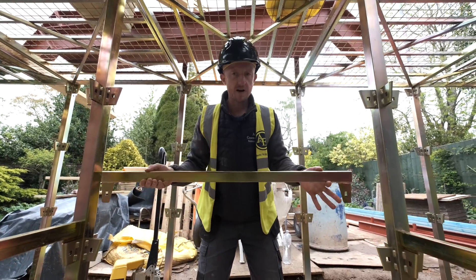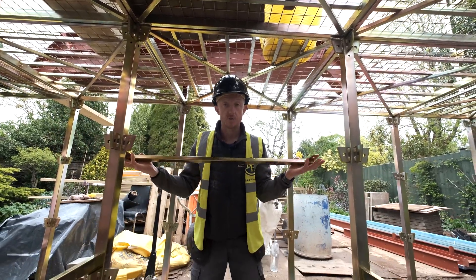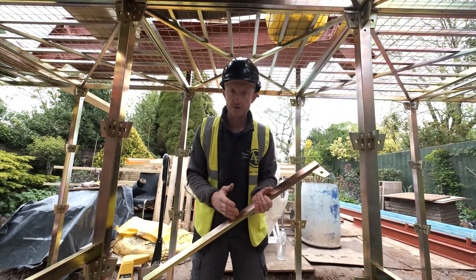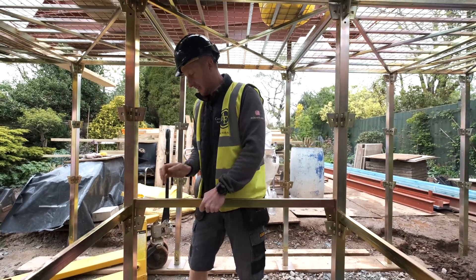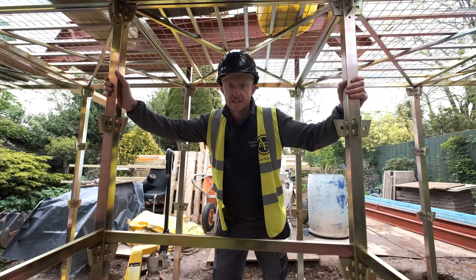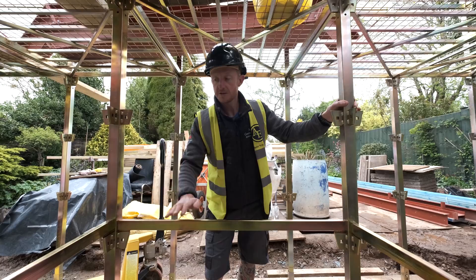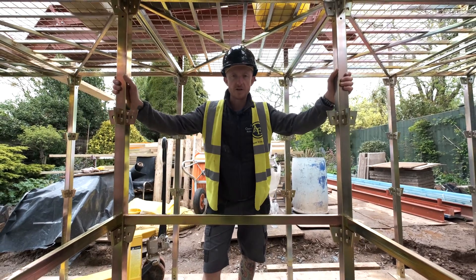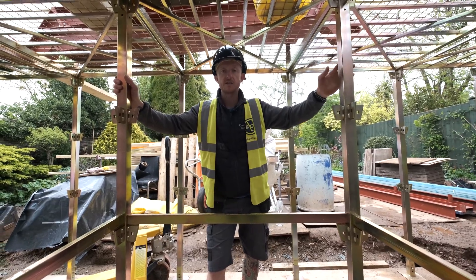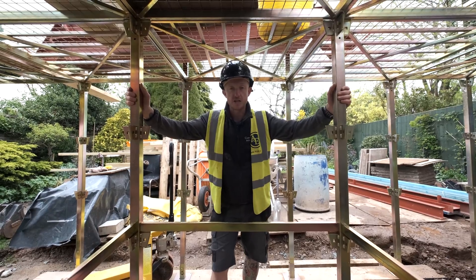These are basically a bar and they come in various different sizes. This is a one square metre edge area so we use this one metre bar. They also come in 750mm and 500mm lengths depending on what panels you're using. Slot them straight in and that enables a lot of rigidity within the frame. You can use this stuff as a free-standing tower scaffold as well — using this system it's really rigid and nice and solid. When you go to a certain height they do provide some additional bracing and stabilisers just to make sure it doesn't wobble, but it is very rigid at a good height anyway.